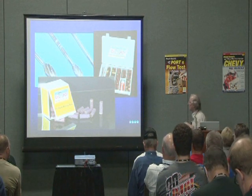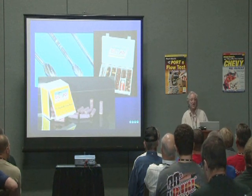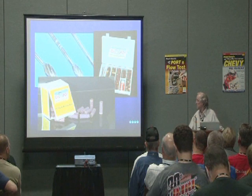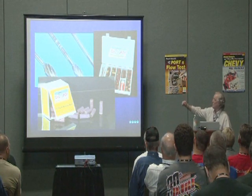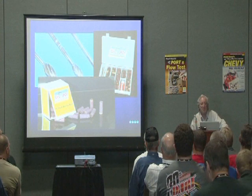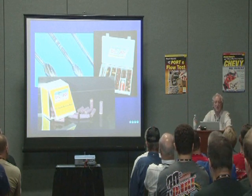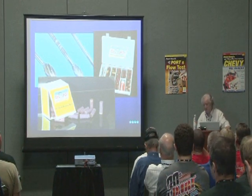The reason I recommend it is several reasons. They have this tool lube, which is considered the best in the industry. It'll stop even a cast iron cutter — which is fine tooth, these are aluminum cutters — it'll stop a cast iron cutter clogging up when it's used on aluminum. Also, the emery rolls and the other stuff in there is at a very good price. You'll find that the only place you can get the same kind of price is probably at some swap meets, but you may have to travel a long way. They cater for it — it's a company that not only sells porting stuff, they port cylinder heads. So you're talking to porting people who have hands-on porting experience.